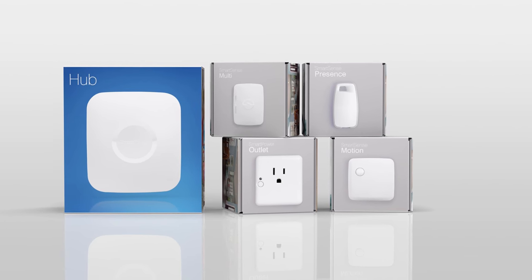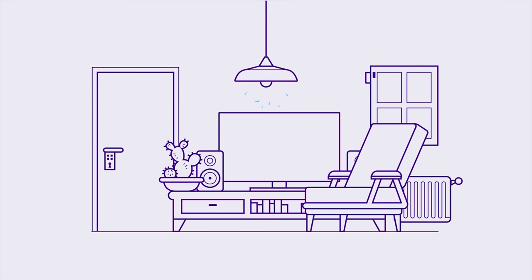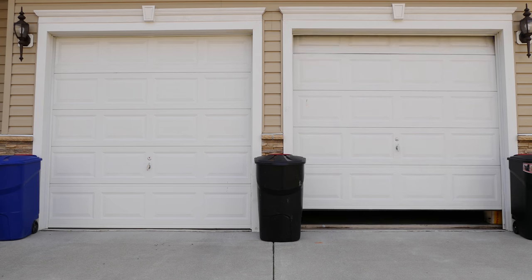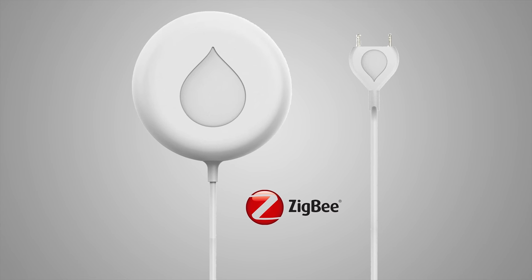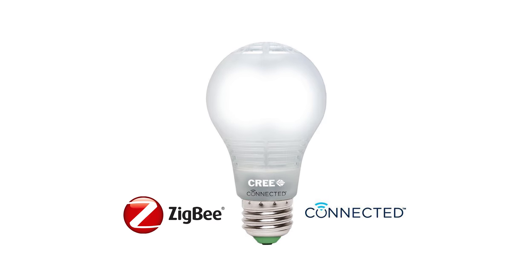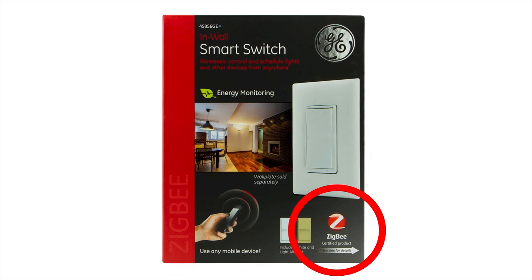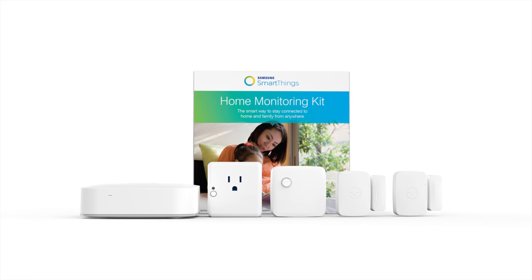The next hub is easily the most powerful of all — the Samsung SmartThings hub. SmartThings not only has Zigbee, Z-Wave, and third party Wi-Fi device support built into it, but it also links with nearly every smart hub and smart device out there. It's also a true home automation hub, meaning you can control devices based on an action or the state of another device. For example, I have my garage door programmed to close automatically if I leave it open, turn off all the lights and turn on the house alarm when I leave the house, and I also have it programmed to call and text me if one of my water sensors detects water. Since it supports both Z-Wave and Zigbee, you have the option of installing either smart bulbs or a Z-Wave light switch to control a bunch of lights, which would be more inexpensive than several smart bulbs. The downside to SmartThings is that it is a bit difficult to set up the automation tasks and the interface can be a bit overwhelming, but right now it is the best option for full home automation.